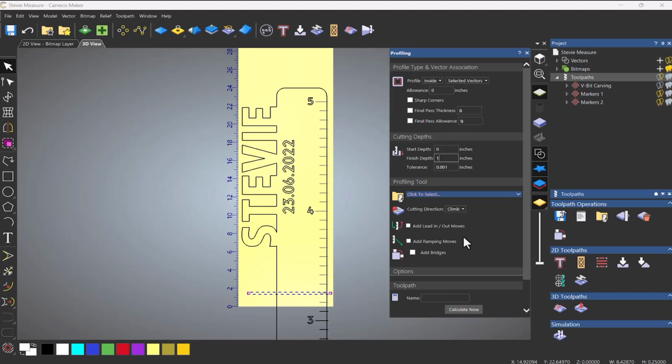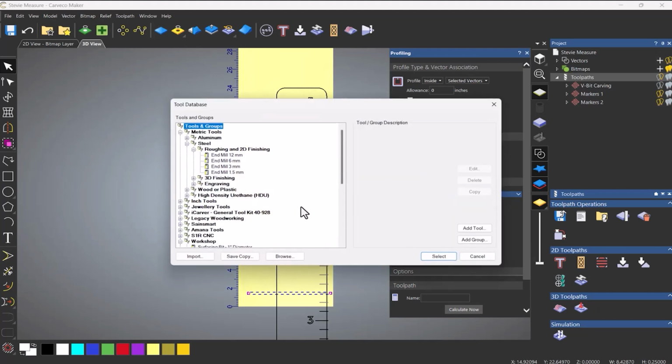Now this is really important. If you don't do this, then basically your dowel will be just going into the wood and it won't be able to slot into anything. So it's basically sort of making a jig on the wasteboard. Make sure that you're not over any T-rails or anything like that. Make sure that you have actually got some wood there. If you haven't, or you don't want to go into the wasteboard, you can always add another piece of wood underneath this prior to actually starting machining. So you basically go into the other piece of wood. Entirely up to you.